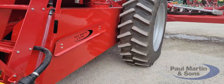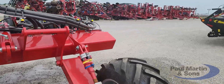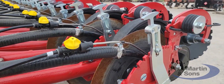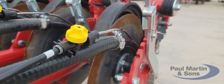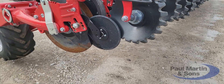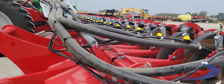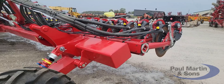We're pumping to each unit — it's pretty simple. We just run a quarter-inch tube to each row. We designed a stainless tube mount using some clamps, and of course we've got a check valve for low pressure. We're putting a pretty low rate on and it's just dribbling it right on the ground in the row. This is all done in sections — I believe we've got six sections, so we have section control with this system as well.